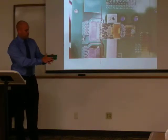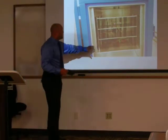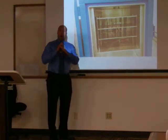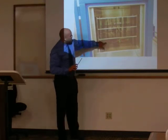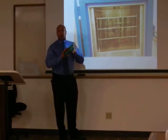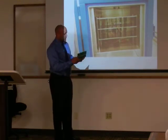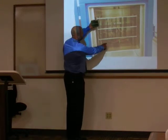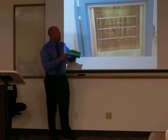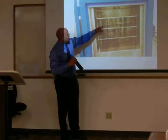Once all parts are loaded into your boards, you'll go back over to your oven, and you'll notice that there's a rack inside this oven. This rack holds the board and allows these cables that are connected to the controller to be plugged into it to supply power and activate the devices. You'll notice that these first 2 slots are backwards. You slide it in, and there's no way to get these cables to the front of the oven to insert. So you have to ensure that all your boards are with this plug in the back.